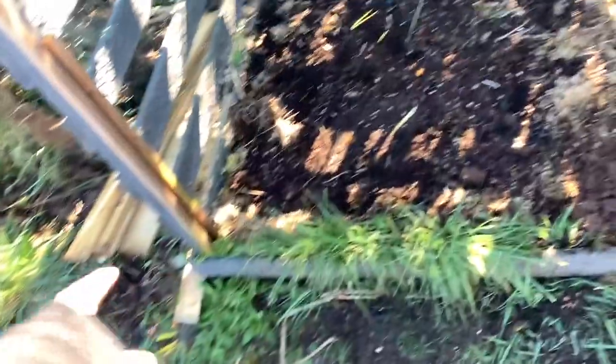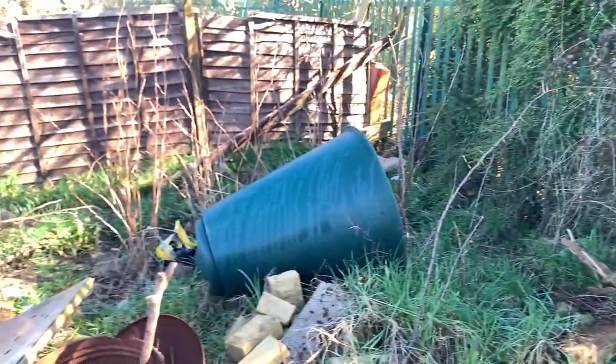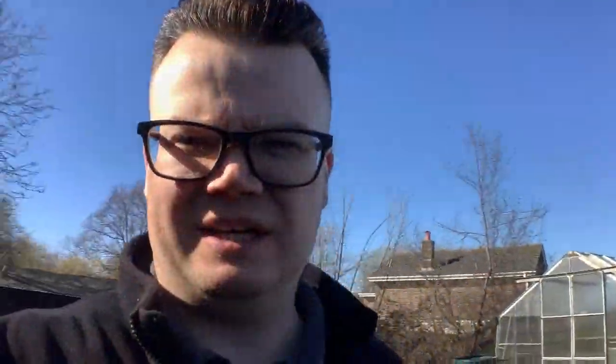The reason for that is I actually want to move this compost bin - I'm not sure where yet. I think I'm moving it along because I might eventually move my shed to that corner. From the looks of things I'm going to have to redo my whole shed. If you follow me on social media, you'll have noticed that I pulled up the shed floor and it's rotting - getting rising damp from underneath. I think that's mostly because I've got it on concrete blocks and haven't put a DPM - a damp proof membrane - down. I might have to get underneath, move any soil away from the floor, and either build a whole new floor and reclad, or get a new shed.